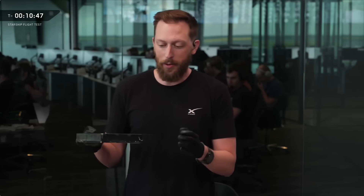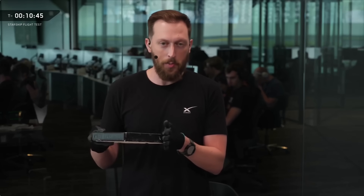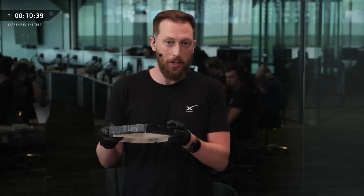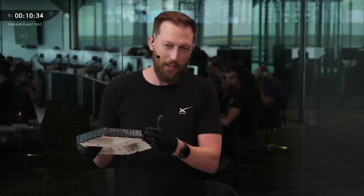For today's flight, we've made a modification to the heat shield tiles — what's being referred to as the crunchwrap tile. We've got thousands of these heat shield tiles covering Starship. They're all next to each other with a small gap in between, because you've got to leave a little bit of space as that metal underneath will expand and contract — that way they don't crunch into each other and start breaking. However, that lets some of that plasma seep through, and we see really high heating on the sides and down on the metal.